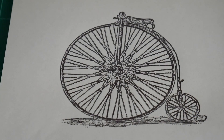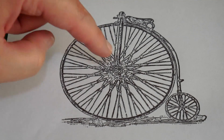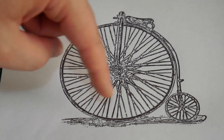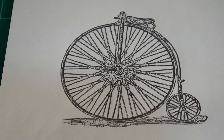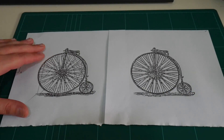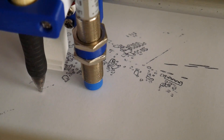And here's the high wheeler bike again with the two changes made from the previous print — it looks much neater. You can see there are no more zigzags where the pen was printing during non-print moves. But what you'll notice is it was never actually printing anything in a straight line, so all these spokes around the wheel are kind of squiggly, and the pen was moving up and down making little dots all over the place. The original and this one look quite similar. For print times, this first image took 18 minutes to complete and this second one took 25 minutes to complete.